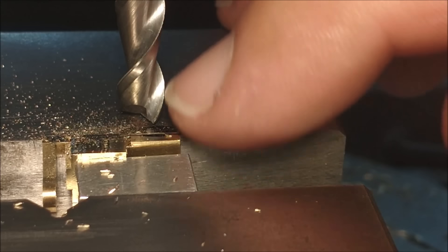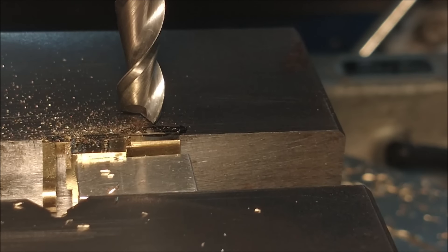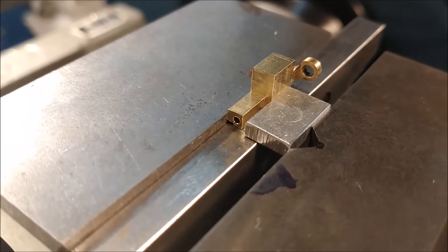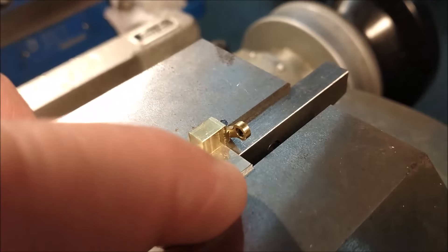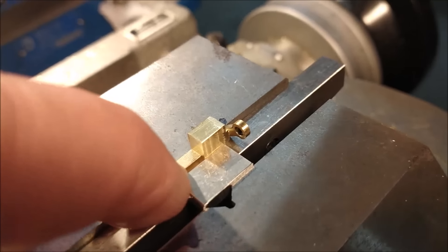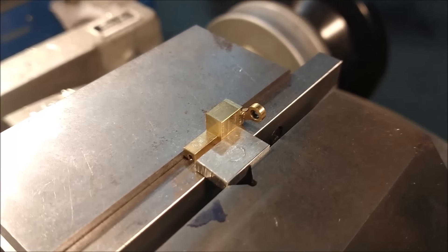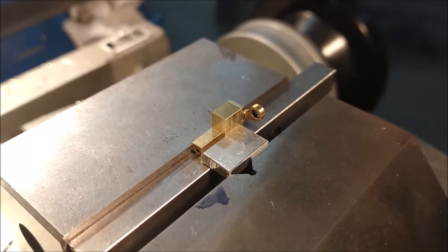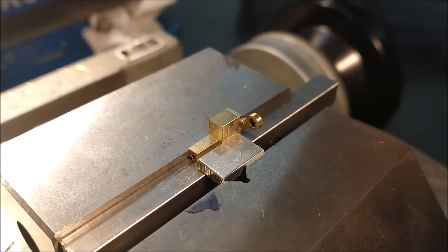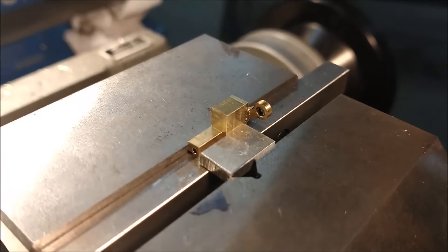Sometimes the part is more important than the shot. I'm going to pull this out and show you what we have — a bunch of finish surfaces; that was a very successful pass. This thing is getting skinny. The T-nut finish surface is registered against the adjustable parallel, and I'm going to have to be really delicate with this cut. I subscribe to a little phrase: 'If the chip exceeds the grip, you can bet the part will slip.' If you're holding on to something with less surface area than the contact of the cutter, the cutter is going to win and pull that part right out — whether it's a lathe or a mill.